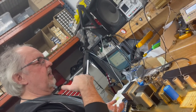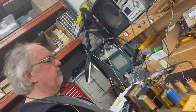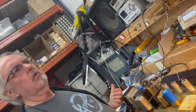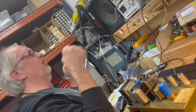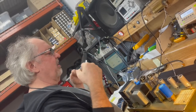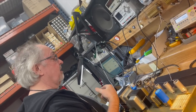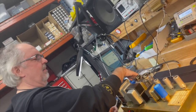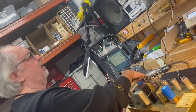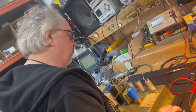When you turn it upside down and an element changes in your observation, what's the next thing you do? Upside down, it's okay. Right side up, it's not. Something's making noise, shake it. Is there something that I can hear? I shook it, and I could hear ka-duck-a-duck-a-duck. I'm like, okay, where is that coming from? The thing that surprised me about that coming from a filter capacitor was that I had never seen that before. So that was a day that I learned something.